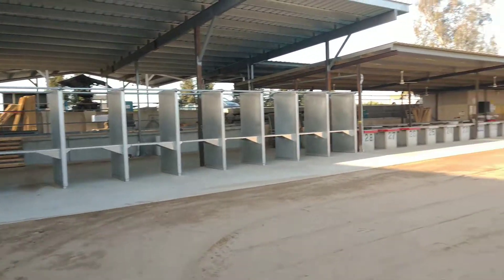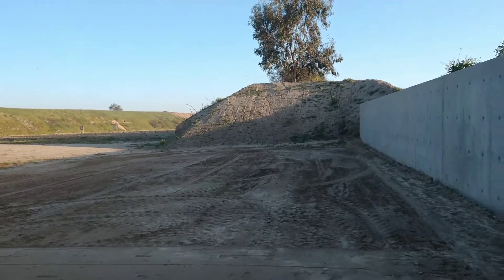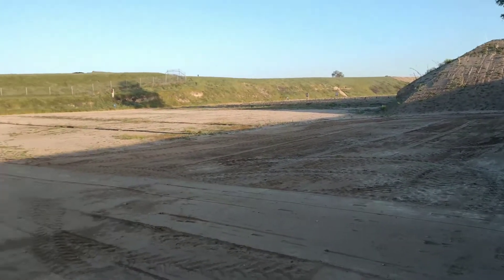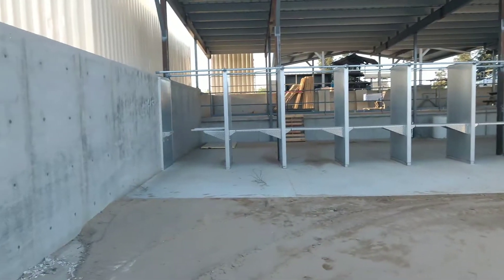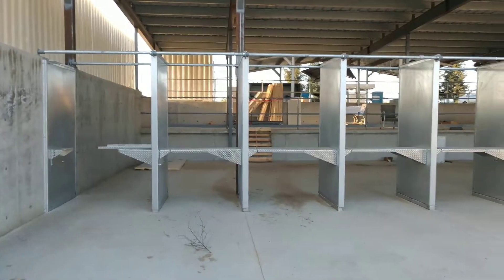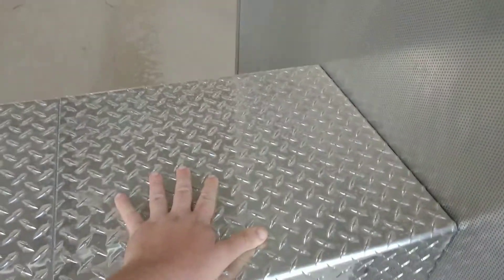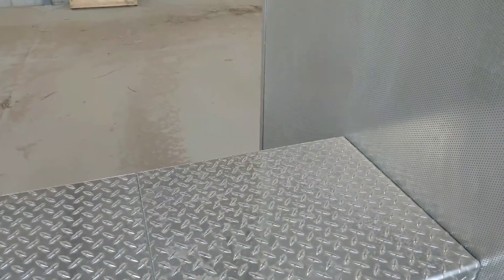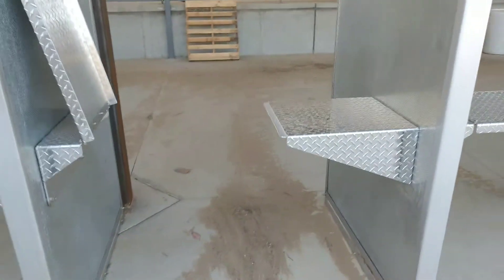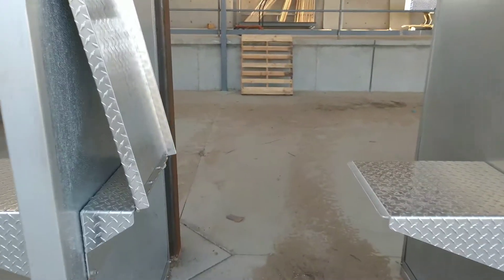We're getting very, very close to being all done, so standing out on the new pistol range - theoretically you've got 35 to 40 yards to the back berm, 10 lanes. The dividers here have a piece of 3/8 AR500, 2 inches of foam wrapped in aluminum, and stainless steel bench tops - real nice. They fold up and down to give you access. The left side is fixed stationary so you can have carpet, gun, magazine, ammunition. The other side goes up and down like a drawbridge and allows the shooter on a line break access downrange to change out targets and sweep up brass.